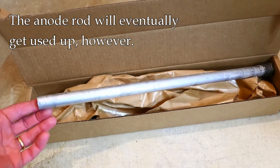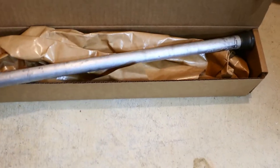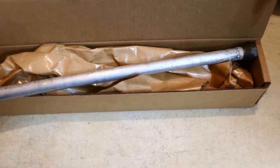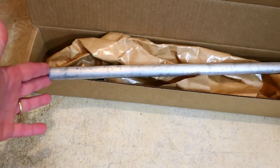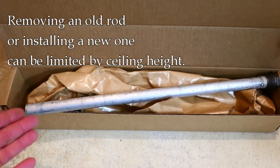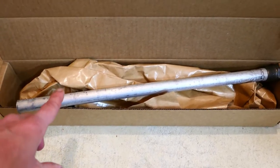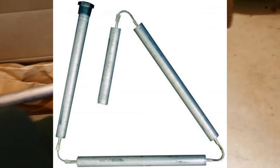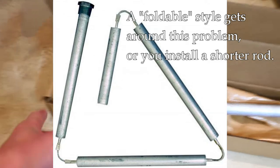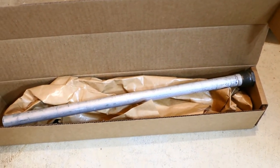It's going to take the brunt of the corrosion and basically disappear in your water over time. These anode rods come in different sizes and shapes, and as mentioned, different types of metal. This particular one is actually pretty short. Many go the entire length of the tank, and that can be a problem because it may hit the ceiling when you're trying to take it out. Another form you'll sometimes see is short pieces linked by wire, maybe a foot long each, which allows it to be folded so you can get it into the tank.